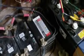And as I've found over here, the deep cycle batteries and the car batteries do live okay together. One does not wreck the other from being on the same circuit, because their voltages are basically the same. It's not so good to mix up, say, gel cells and flooded batteries. That would be bad, because then you're going to wreck one from overcharging or the other from undercharging. But deep cycles and starter batteries, not too bad. Not ideal. Once I get 2 more of these nice big 225 amp hour ones, I'll get rid of these ones, but they've done fine for now. So there we have it, a tale of batteries.